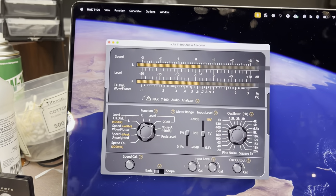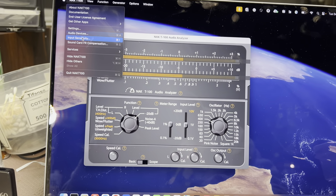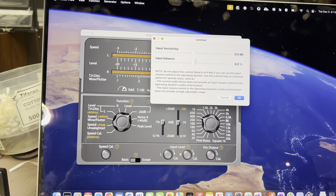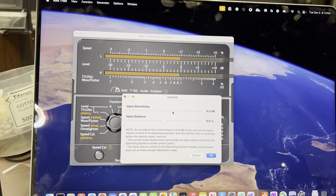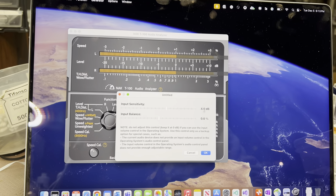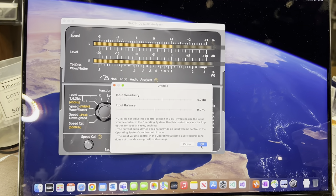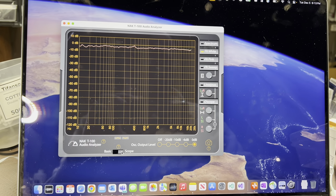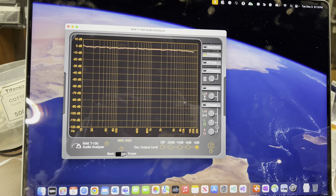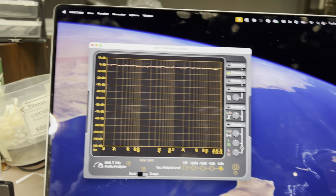What we need to do is correct sensitivity by those 4 dB. I will just add plus 4 — 4.0 right here. And that's where we have zero. Now we have our chart straightened up.